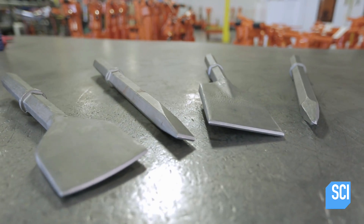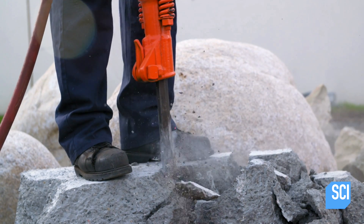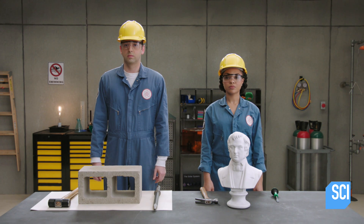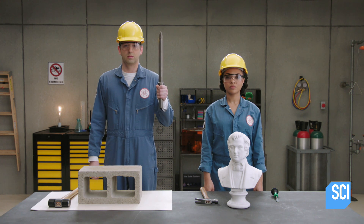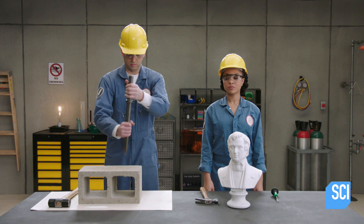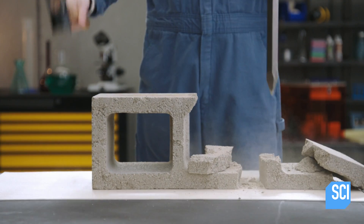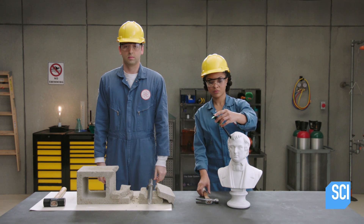The business end of a jackhammer is the front end assembly, and that has a bit. That bit, pounding the concrete, can bust up to five inches of concrete. Our test laboratory scientists will now demonstrate. There are several types of jackhammer bits, each designed for a specific job. Two of the more common bit types include the pointed bit for general breaking, and a flat-tipped bit, which allows direction control for final edge finish.